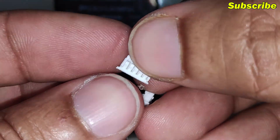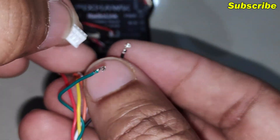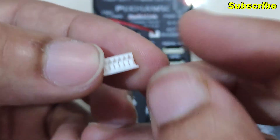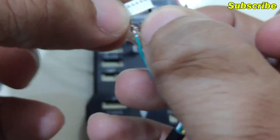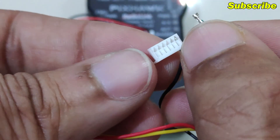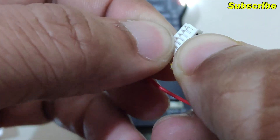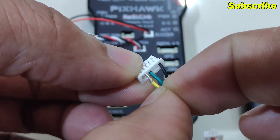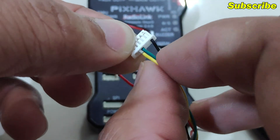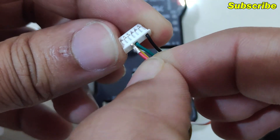The wires have been separated from the five-pin connector. Here is the six-pin connector. At this stage you don't want to install the wires in the wrong order because there is a chance you can fry the GPS module. The ground wire will go on the connector at the far right end, then connect the green wire to the third pin slot from the left, after that the yellow wire on the second hole from the left, and then the red wire for power on the first left connection.